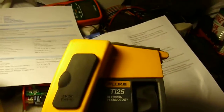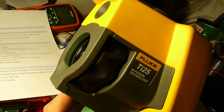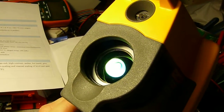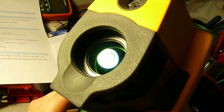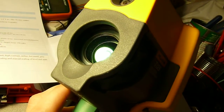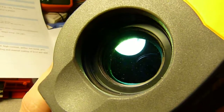This is a great tool. If you're doing electrical inspections, mechanical inspections, you can see overheating motors, generators, ball bearings, buses, cables. One interesting thing is that glass is actually opaque to infrared light. This lens is, I believe, made of zinc selenide - though lenses can be made of germanium or silicon as well. As you can see, you can't really see elements inside because the infrared lens is actually opaque to visible light.